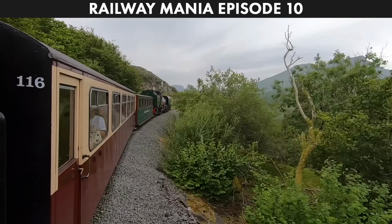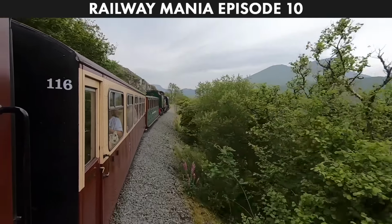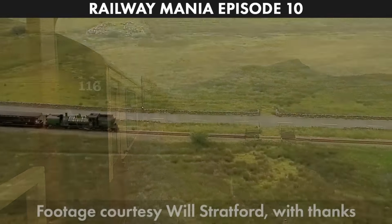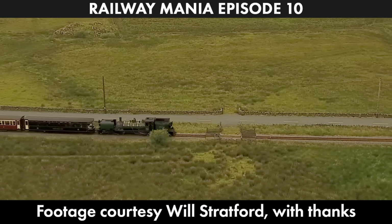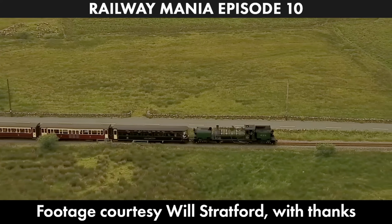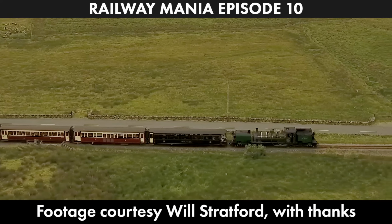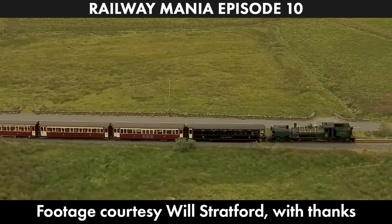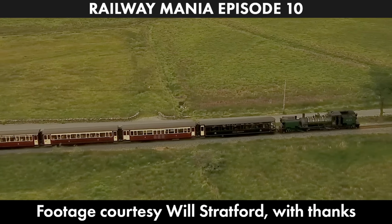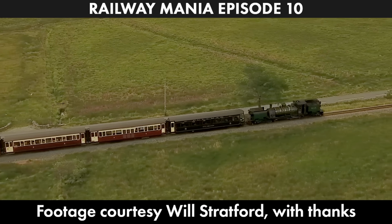But what we've done recently, we've redesigned the lubricator drive, so it's a lot lighter weight. The idea being that it doesn't thrash around underneath the engine and wear a lot quicker, with modern clevis ends. So again, if they wear out, we can just put a new one on in minutes. So this is about day-to-day maintenance. It's improving the amount of time that the vehicle can be available for traffic. Yes, that's the end goal.